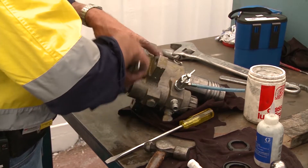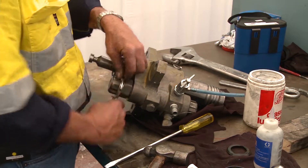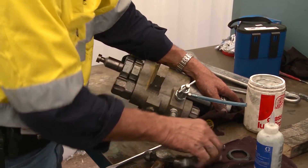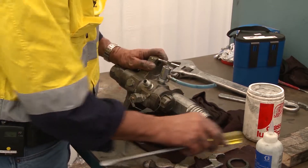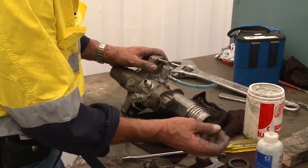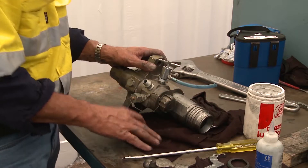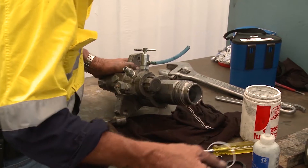Is there any need to fill this pump with paint or solvent to prime it? Absolutely no need whatsoever. After a new installation or repair, run the air motor for five or six revolutions to start the pump sucking material in. You can pre-prime the feed hose or fill it with solvent to assist — we'll more than likely do that before proceeding with the pump.